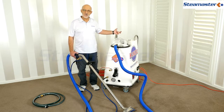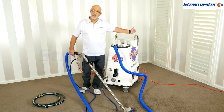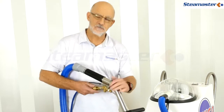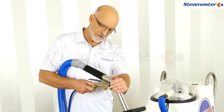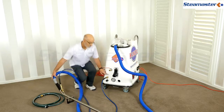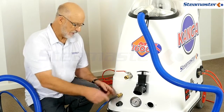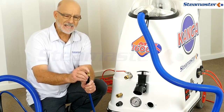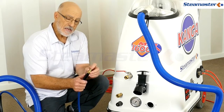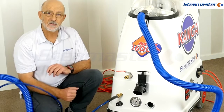If you've checked the water level and the motor is running with all the right noises but still nothing's coming out, it could be that the little quick connects aren't fully engaged - they might be just there but not quite clipped on. Make sure you get that click and it's on there tight, same at both ends. There's a little valve in each piece, and if they aren't meeting and opening those valves you won't get pressure.